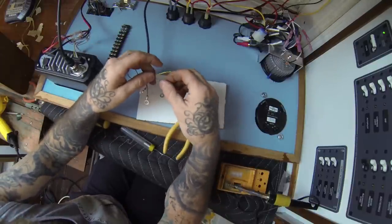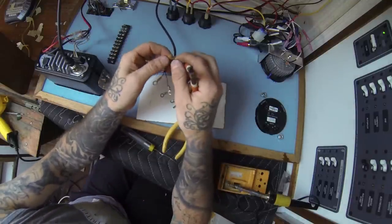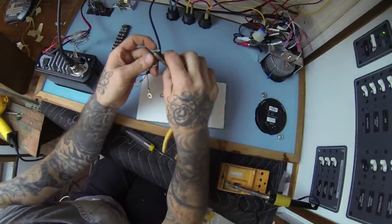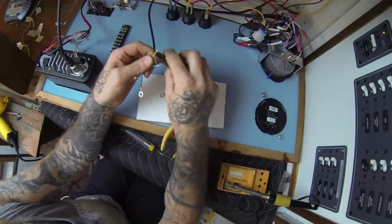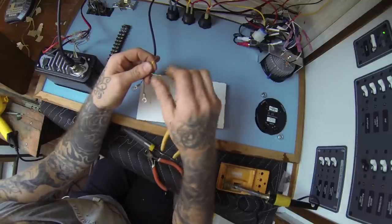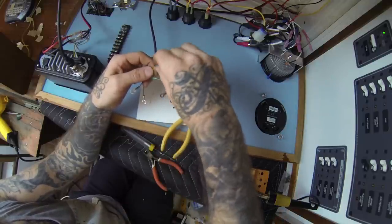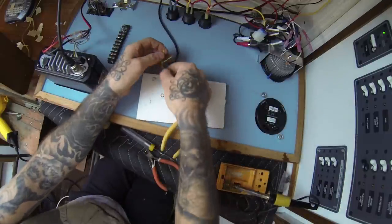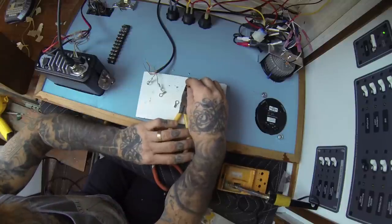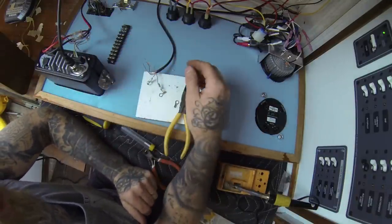In my mind, if this all works right the way I'm imagining it, our VHF is going to send out our GPS coordinates via NMEA, and then it's going to go to our AIS Wi-Fi little unit here, which wirelessly transmits the data to our iPad and our iPhones. And then we should have our GPS beaming in. But we'll see — I never messed with this stuff, so maybe it'll work, maybe it won't. I have a GPS unit I use for my iPad anyway, but I thought if there's one in here, it couldn't hurt to share the data since we have the network.